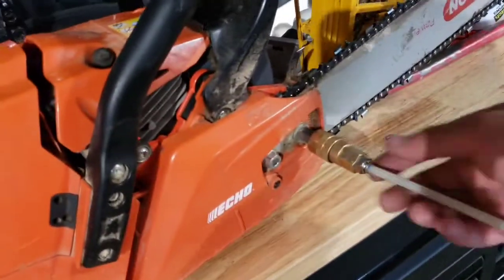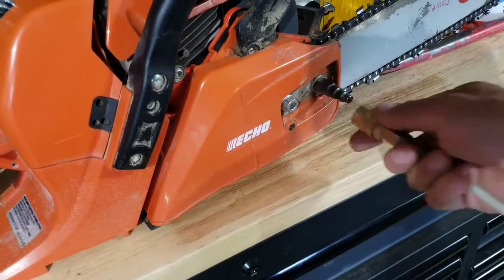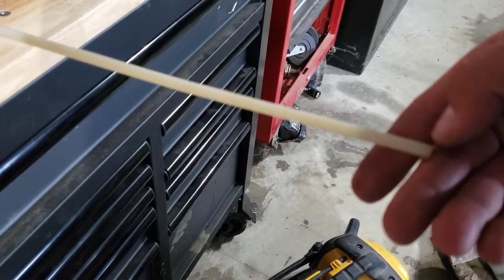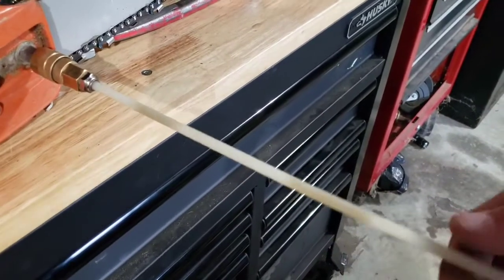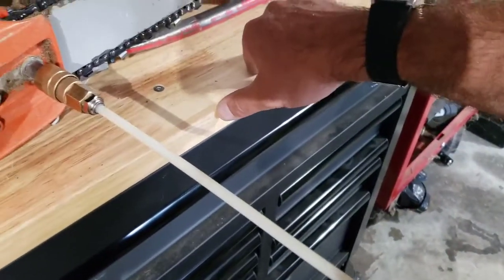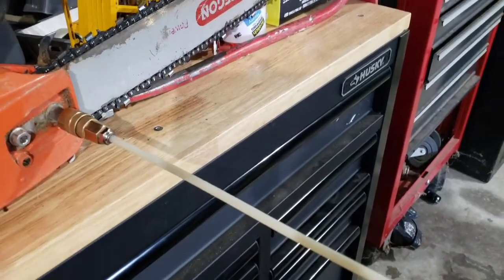When you get this thing, they give you about an 18-inch rod. What I did, I hooked it on here, took out my tape measure, measured from here to the end, and marked 16 inches. At 16 inches, I put a black marker mark, and then I snipped it with a pair of snips. This way you get your full 16, and it's pretty close. You can cut from either side of the saw with it, just by using this at the end of your piece, or by putting your bar at the end of your log and then looking at this piece and cut. Both work equally as good, I guess you can say.